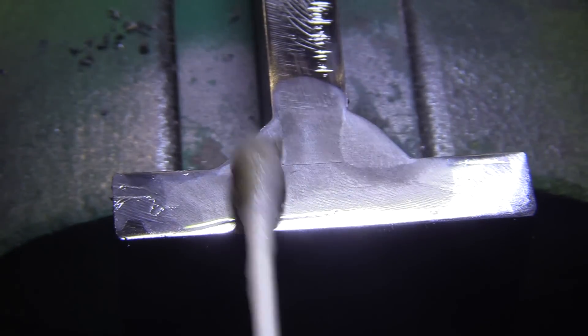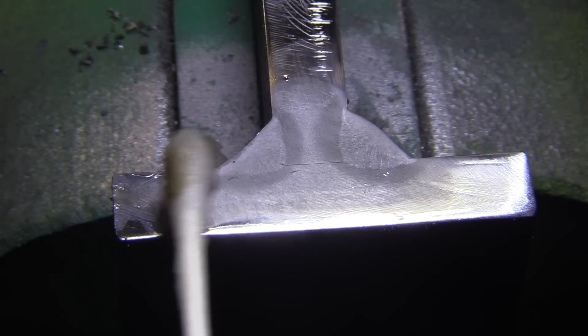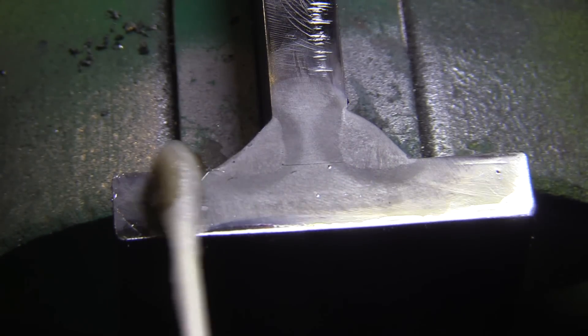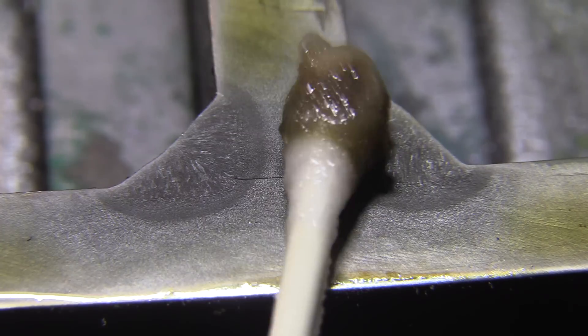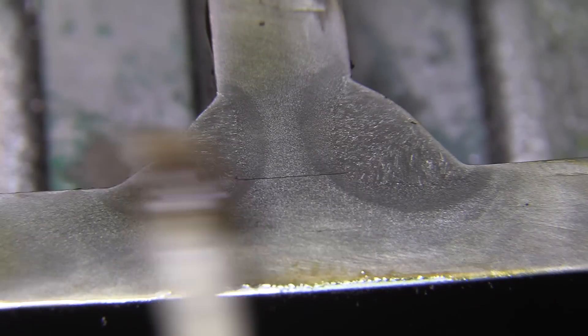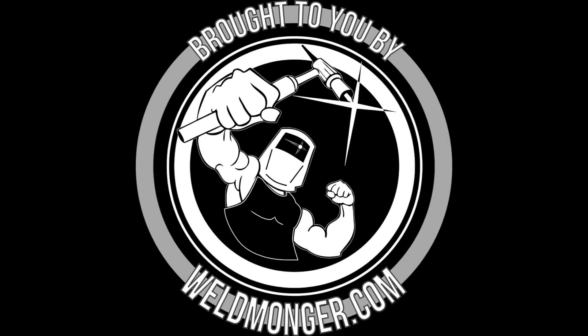The dual shield cross-sections: the one on the left is the high wire feed speed weld, and the one on the right — slightly more convex — is the 270 inches per minute weld with much slower travel speed, which accounts for the extra build-up and a slightly larger heat-affected zone. Travel speed probably has more effect than any other variable on heat input — it affects penetration, bead profile, and everything else. On a cut and etch you don't want to see anything indicating lack of fusion in the root of the joint. Sometimes what appears to be lack of fusion is just a rounded edge behind where the root would be. Thanks for watching — if you like this kind of content, make sure to subscribe and we'll see you next time.